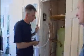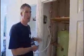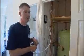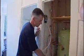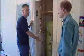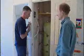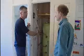As well as the panel, there's some equipment to go in the attic and a new hot water tank. We take out the existing hot water cylinder and replace it with a larger cylinder with two coils in it. The first coil is the existing boiler coil that your gas or oil heating would be using. And then for solar, we have a new coil at the bottom which is dedicated completely to being heated by the panel on the roof. That allows us to heat water with just solar and not interfere with the boiler.